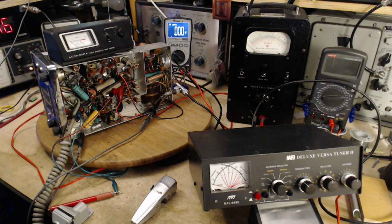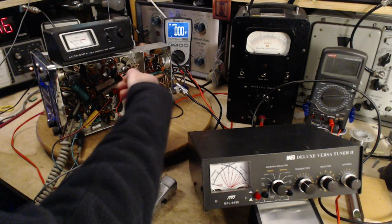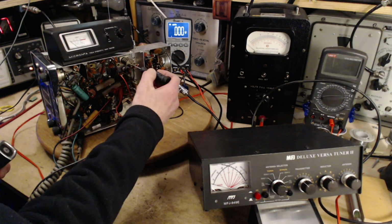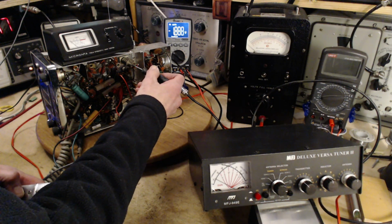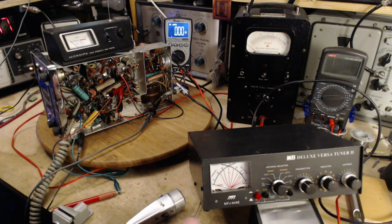Okay, let's do a sensitivity study now. How much is this voltage affected by turning the two controls, particularly that capacitor? Okay, I'm in. How sensitive is it? There we go. You can see on the scope a tremendous variation in the output. Oh, you can hear my voice. Hello! Hello! See it up here too. Somebody says hello back. We should jump, because I'm only transmitting into a dummy. I'm a dummy transmitting into a dummy.